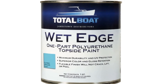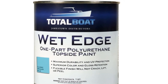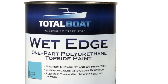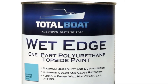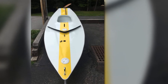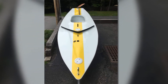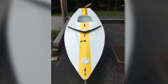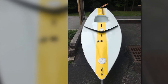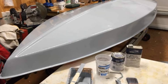It is reliable in terms of obstructing solvents, moisture, alkalis, acids, and oils. If you opt for a sturdy and hard finish that is not susceptible to lifting, this is the best match for your requirements. It also provides superb coverage, is not a hassle to use even for newbies, and dries relatively quickly. This is not prone to mildew accumulation and other sorts of stains. It can cover 250 to 300 square feet per gallon, and is available in white and gray, in gallon and quart sizes.